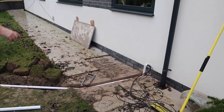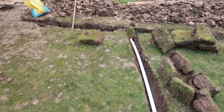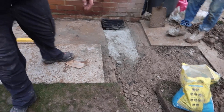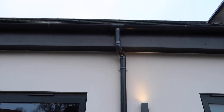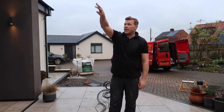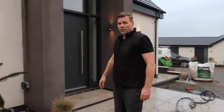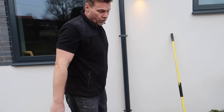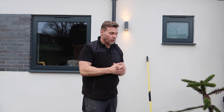We're using 32mm waste pipe and we've come all the way along the trench, around the corner, and it goes into the garage just behind there — keeps everything protected. We're putting a bit of waste pipe close to the wall so from that side you won't see it. It was literally the only way to get from the garage to the house. We enter in the soffit — we've already got our hole up there — then clip it up the trusses to meet a junction box we've already got in place where all the strings connect.